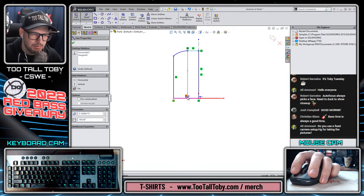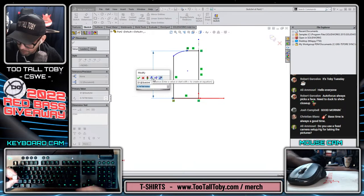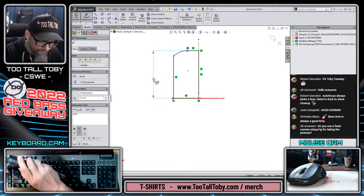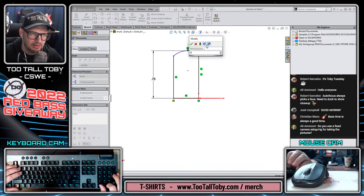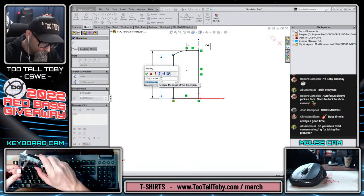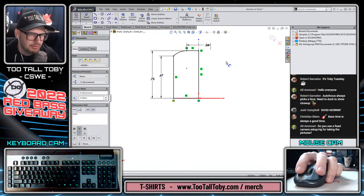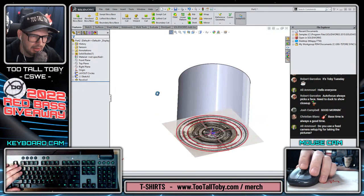Let's say that we want the max height of this knobby to be, once again, 0.75. I like that. I like when the geometry is clean. And then the point of tangency here from center is about 0.36. Obviously, this isn't going to be perfect, but we can certainly try to get it close. And then our distance to the lower point of the knobby, kind of where that runs into, 0.666. Love it. I'm loving this numerology this morning. Features, revolve. We can revolve that thing around, give ourselves the main shape